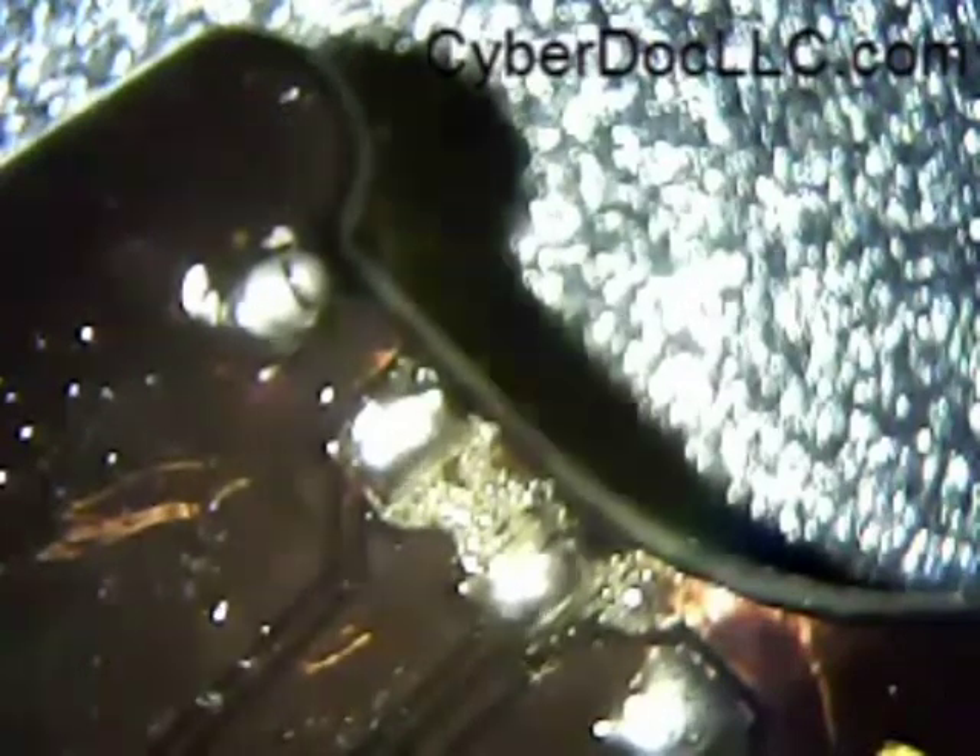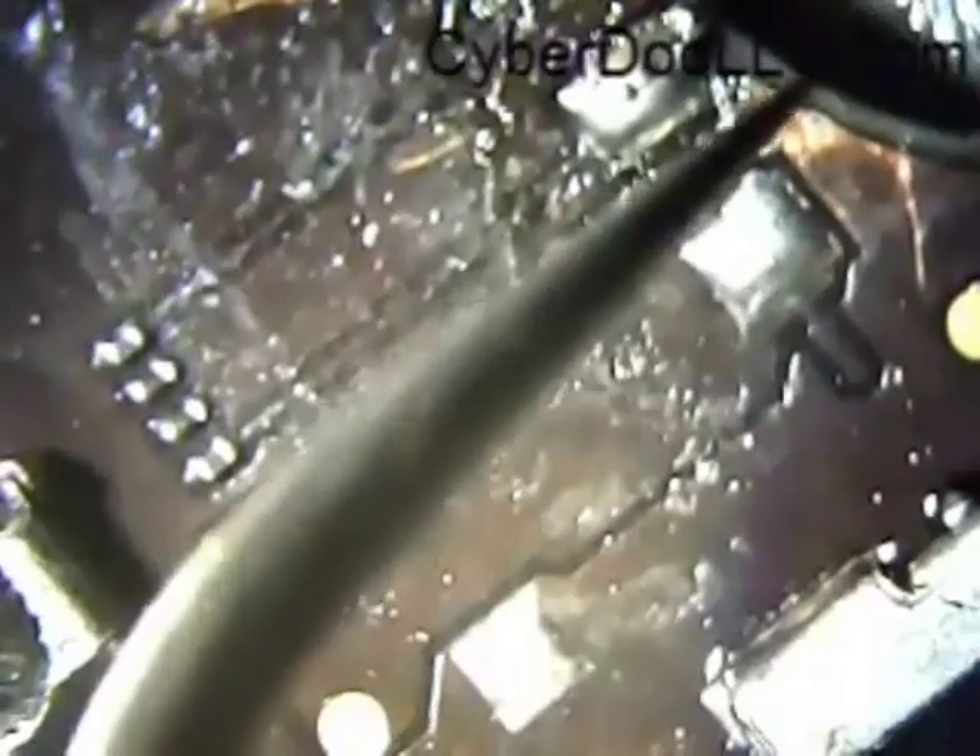So now I'm just cleaning off the excess paste that's not needed. It forms a bridge, which is okay right now because it's mostly solder balls — you could scratch it off easily. It's not actually forming a bonded bridge. Even if it does form a bridge, you can just easily push it off, like what I'm doing right now. I'm going to melt off all the solder balls because I don't want to damage it by scratching it — it's already scratched quite a lot. It's not really a bridge; it's more like a lot of little solder balls. Now is a good time to put flux on the logic board.